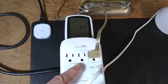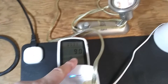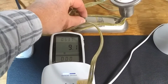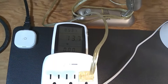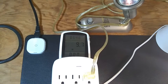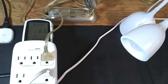According to the instructions, you need 10 watts to trigger and turn on the switched outlets. With 8.9 watts shown on the power meter, the output is off. Turning the dimmer slightly to increase consumption — now at 13 watts — it turned on. Turning it back down to 9.7 watts, and after about 8 seconds it should turn off the switched outlet. It did turn off. No flickering, working perfectly.